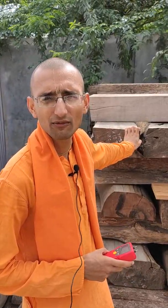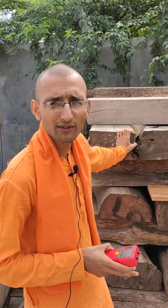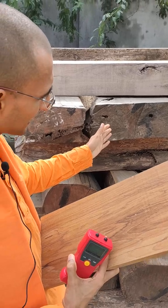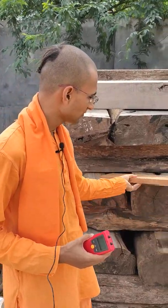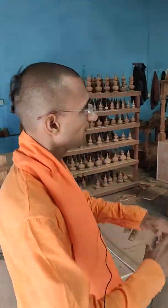They just keep on drying, and when the wood is wet we use a moisture meter. Teak wood generally doesn't have as much moisture as other varieties of wood, like neem, babool, and other local Indian varieties, which have very high moisture content — about 50% in the deep inside part. But in the case of teak wood, the maximum moisture content inside is about 30-35%. When we want to use a piece for final work, after storing it as logs and cutting into small pieces, this kind of piece has a moisture content of about 10-11%. Anything below 12% is acceptable for our work. Naturally we can feel that it becomes quite light — if the wood is heavy, its moisture content is high.